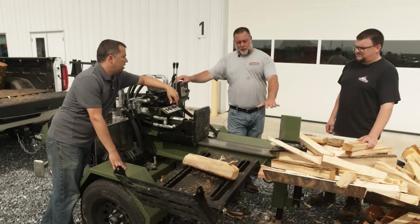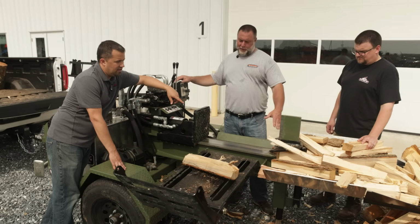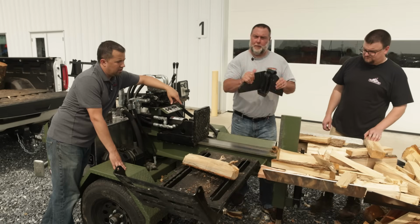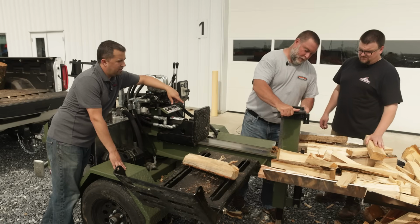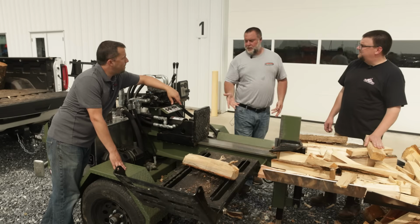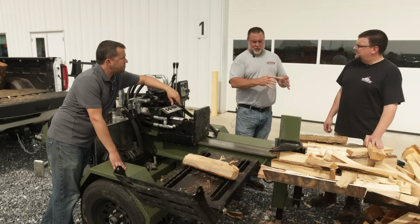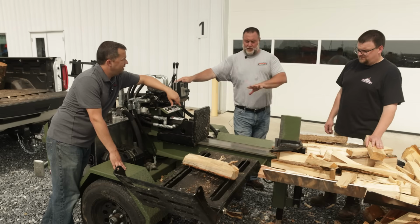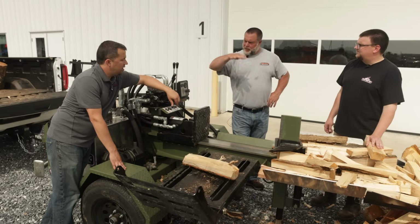Yeah, and that's why it's critical why I chose WolfeRidge. I'm able to switch between the 4, the 6, or the 12 in seconds. You simply pick it up and you can set it aside and put it back on. There is a pin that keeps it in place for safety reasons. So you can adjust it, change the wedges out. If I'm running a tree, it will have 4-inch, 6-inch pieces up to 30, 40-inch pieces. So to maximize my efforts, I change that wedge out pretty regularly, and I'm always changing the height.